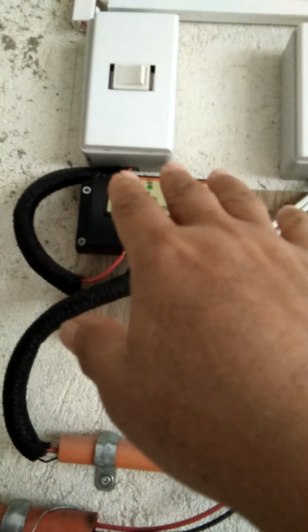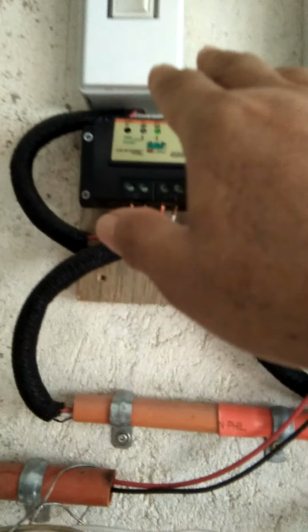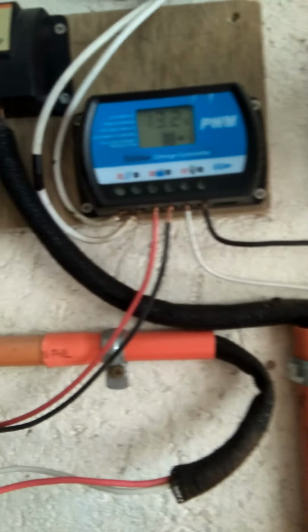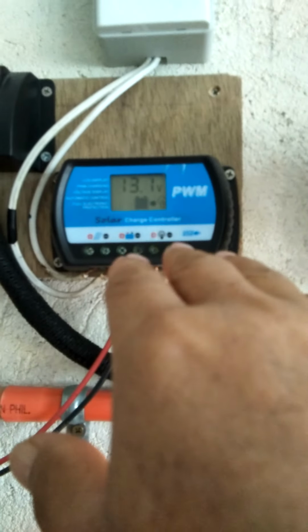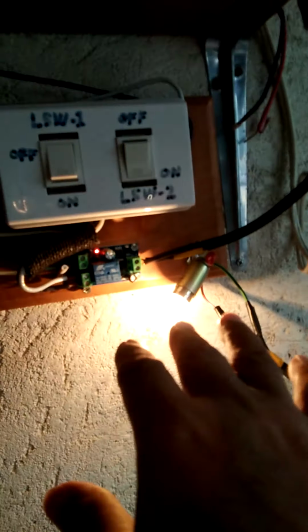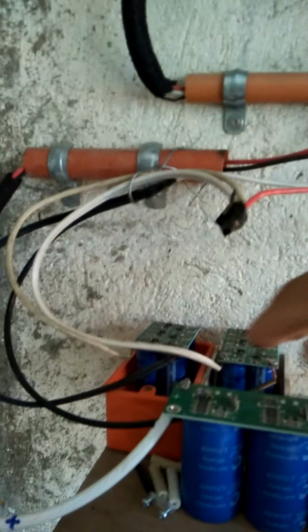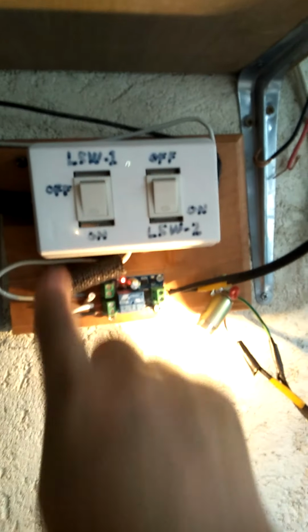and bypass switch number 1 and bypass switch number 2 are still open right now because there is still remnant energy from the supercapacitor number 2. It's still high, 13.1 volts, but it's going down because of the load. So I'm getting the energy flow ready from this supercapacitor number 1 by closing the load switch number 1 as a standby.